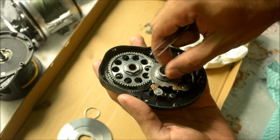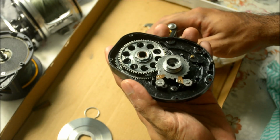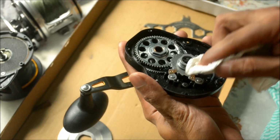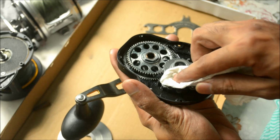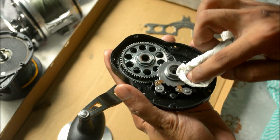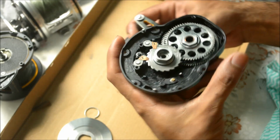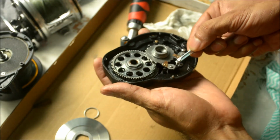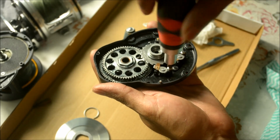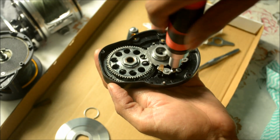Always maintain the right side plate in this upright position where gravity is not pulling it out, so it's not dropping down, because it will bend the spring, so you need to be careful. Just use a very light amount of grease on this, and otherwise, again, you probably won't get engagement if you use oil or anything too slippery. So here you can see we're engaging. They are double dogs, and they are synced, so you get as little backplay as possible. Right, there's 2 screws that hold this in, so once you get that in, fairly simple.